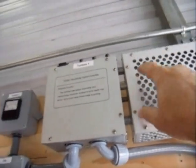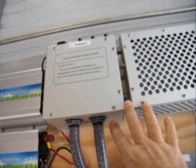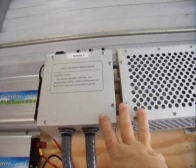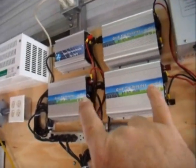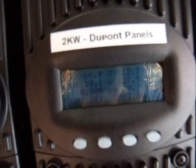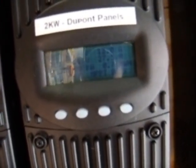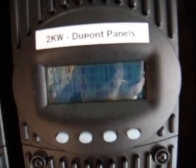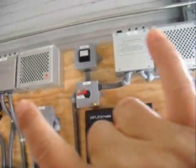What I'm going to do is disconnect the resistive loads from both of these and wire them straight to here. Since these are connected to my 24-volt battery bank, as soon as these guys feel there's a need to dump power, that power will be dumped to my grid-tie inverters — which is 1.7 kilowatts — and they'll make power. That way this system will never actually finish because it will always be keeping the batteries full. The rate of discharge on those batteries will maybe be 5% at most, so I expect very long longevity — I'm not going to be cycling them up and down and sulfating the plates. I also have a desulfator permanently hooked up to those.